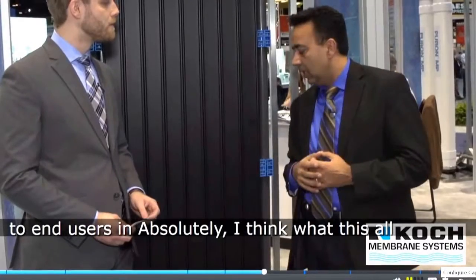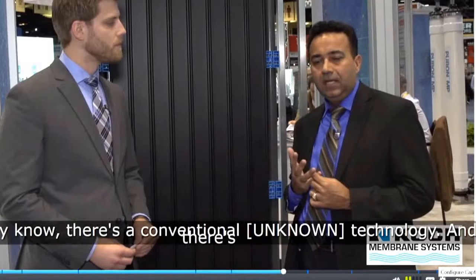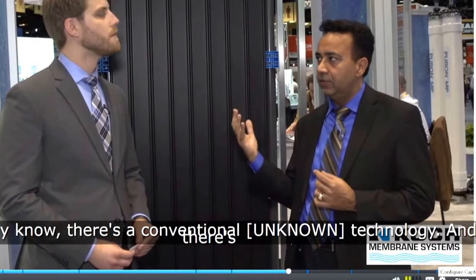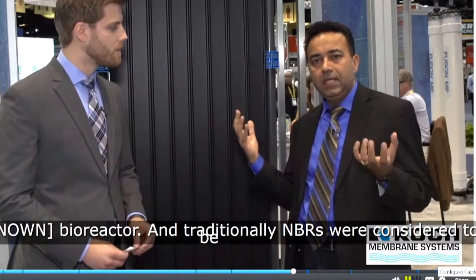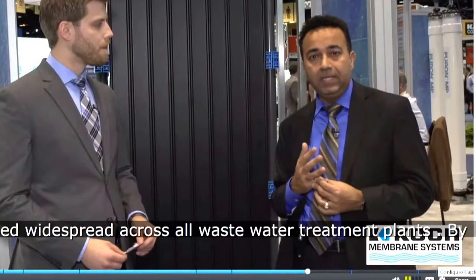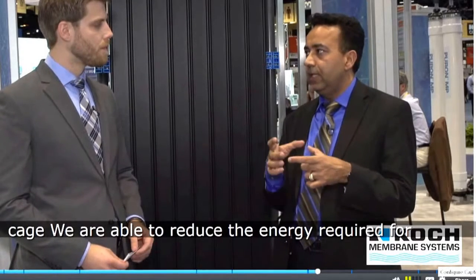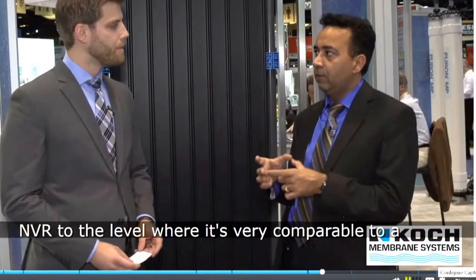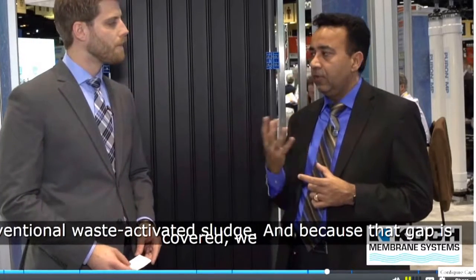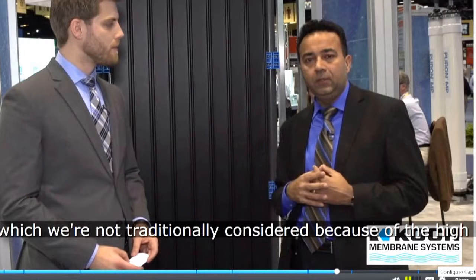Absolutely. I think what this all means is two big savings for the customers. One of them is the energy cost, which is one of the main drivers for any MBR technology right now. As you may know, there's a conventional waste-activated sludge technology, and there's a membrane bioreactor. And traditionally, MBRs were considered to be more energy intensive compared to conventional activated sludge. And that was one of the main reasons why that technology was not used widespread across all wastewater treatment plants. By this pulsed aeration system, where we introduce the bubble into that cage, we are able to reduce the energy required for MBR to the level where it's very comparable to a conventional waste-activated sludge. And because that gap is covered, we believe that this really opens up a big market for MBRs, which were not traditionally considered because of the high energy cost.